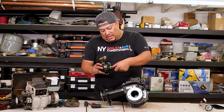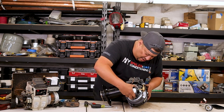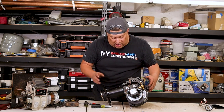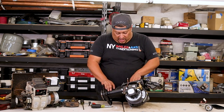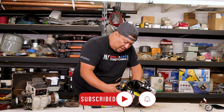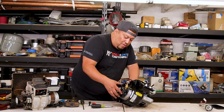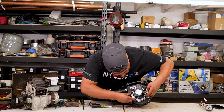Hook the coupling up to the shaft just like this. Sometimes you have to play with it because there's only one way it fits — you're going to find that sweet spot. What I like to do is loosen it right here, play with the actual motor or blower wheel, and you'll feel the sweet spot go in. Once you find that sweet spot, now you know it's all the way in.